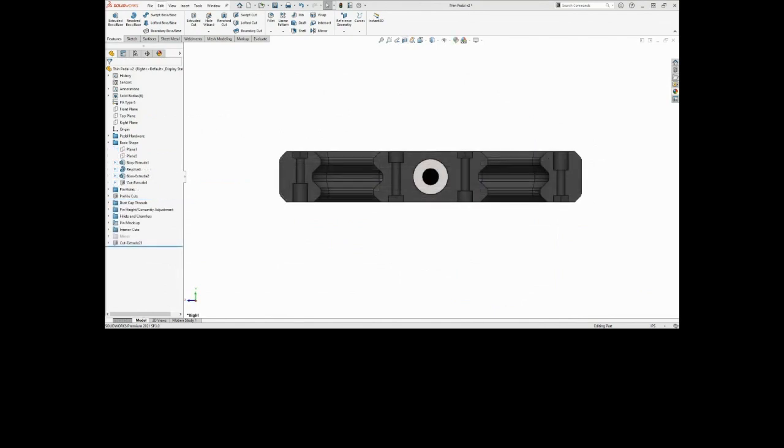Additionally, looking at a cross-section of the pedal, you can see that there's a couple things going on. Those of you that bike will be familiar with the concept of concavity, but sometimes riders like pedals to be concave or have a kind of curved shape to them. And while this introduces support material in this orientation, I'm going to be printing it sideways like this, with the largest surface down, for many reasons.